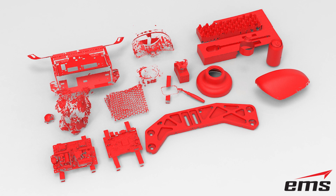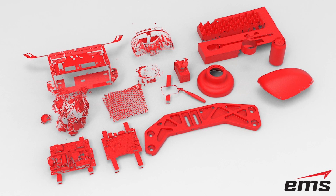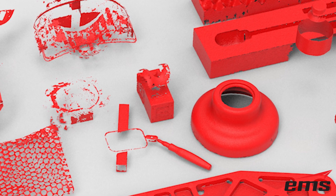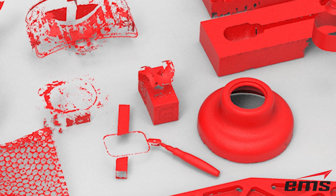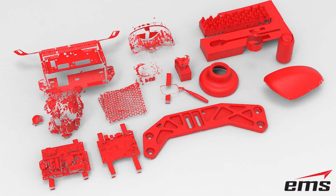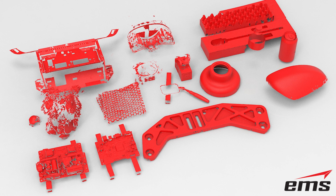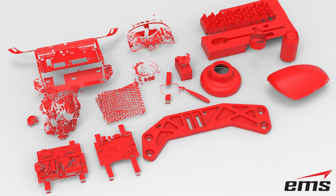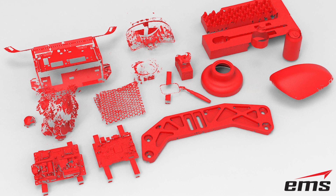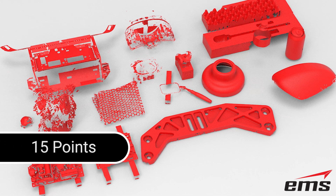So let's take a look at the results. Overall, the HandyScan 700 did a great job, especially when you consider its price point. It did struggle a little in the round corners on the aluminum machine part and certain small detail areas of the black plastic part. The chrome replacement knee was a real challenge with its curved surfaces and shiny material. The two clear LED lenses were also a real challenge with very little data acquired. The foam, electronics, round chrome part, soda can, and carbon fiber part all 3D scanned well. The HandyScan 700 completely scanned six parts and partially scanned three more, scoring a total of 15 points.